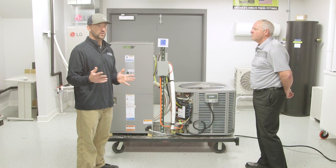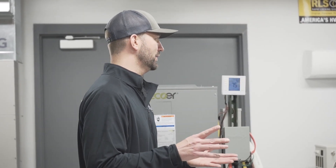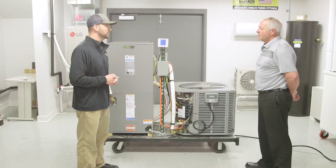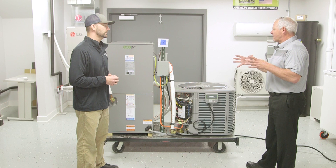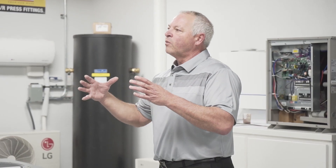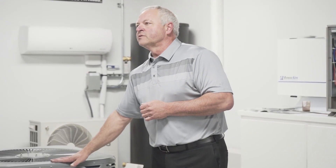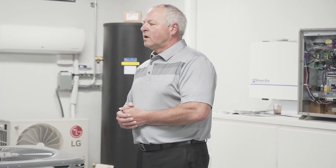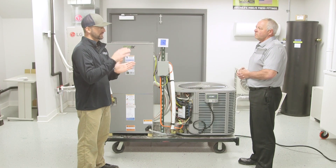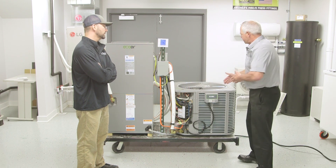Tell me about the sizes — most products have two-ton, three-ton, four-ton, five-ton. This only has two sizes. How does that work? Because of the inverter capacity and ability to ramp up and down, we offer two popular items: a three-ton and a five-ton. This three-ton system can be put into a two-ton capacity by simply making an adjustment at the board — it's just a dip switch setting. So it can go from two to three-ton, and the larger size is a four or five-ton. That model is only about six inches taller with the same footprint.